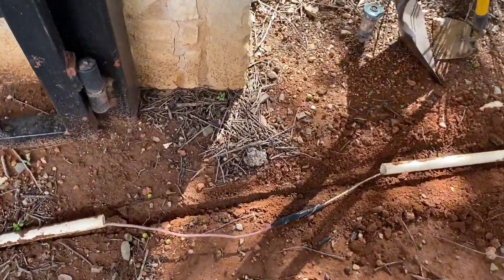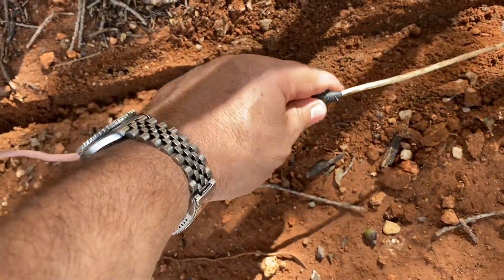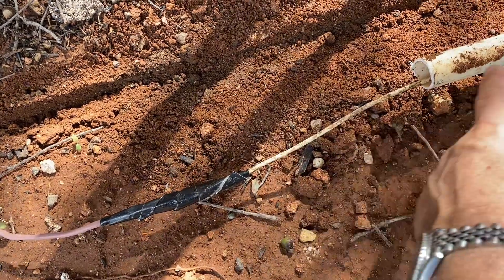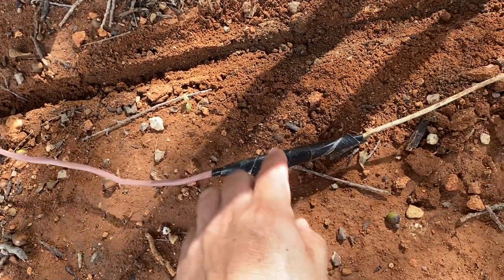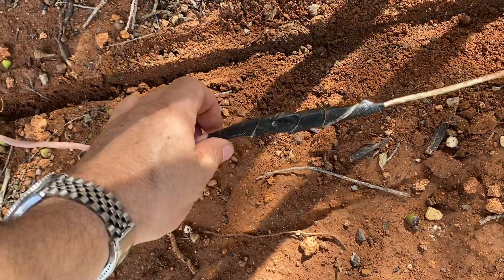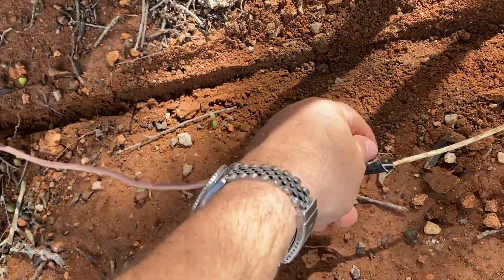This is probably where the problem lies — I'm hoping it's in here because this feels wet. As long as the wire all the way through to the Linear is intact and this short run going back to the control board is intact, I think this is where I'm having some spillover. So I'm going to take this all apart, solder it, waterproof it really well, and then put it back.